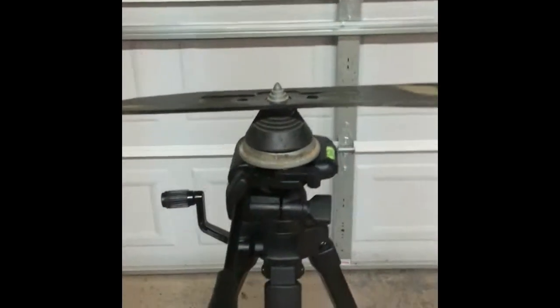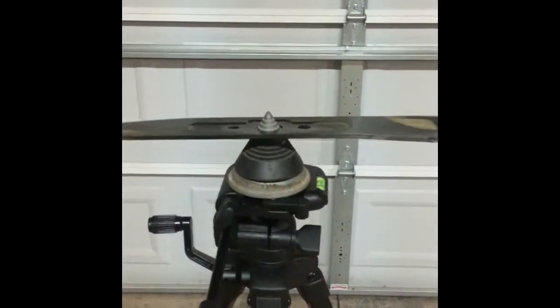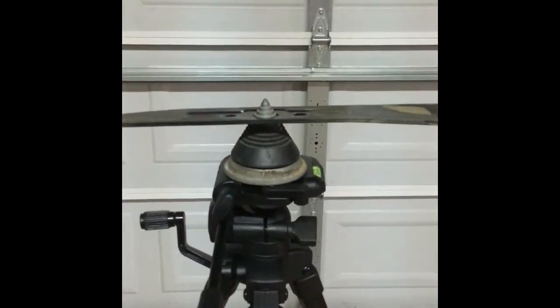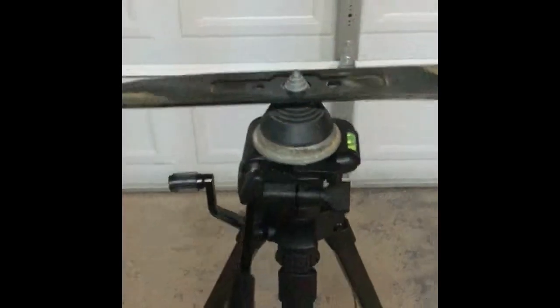Even though I used my workmate to work on top of, you don't want to chuck these into a vise or some kind of clamp that would destroy that bow or that twist, because to work properly that's got to stay in there. I just held it by hand and was real careful. I used leather gloves and I would highly recommend that, because a lot of times you'll have a reflex when you grind — the dust flies off and as a reflex you'll try to flip it off with your hand, and that edge is pretty sharp right now so you definitely don't want to get careless around it.